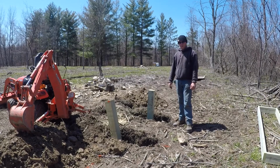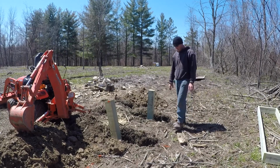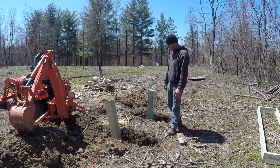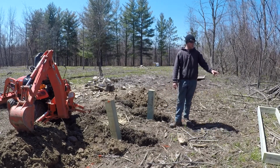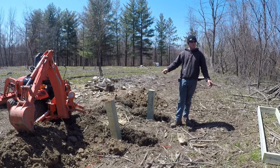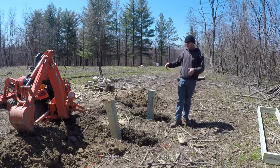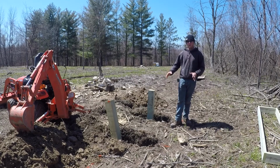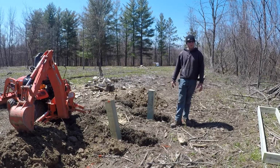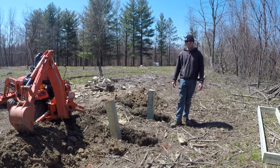Well, you guys, I actually didn't expect the digging conditions to be so good. I mean, I got dry holes, everything's perfectly shaped. So I'm actually gonna frame this up on that 4-foot center for those 6x6s. And then I'm just gonna slip it on there and then set everything all at once. Maybe even tack a few screws in there if I'm having troubles with it moving. But I'll try and measure it out to being a tight fit.